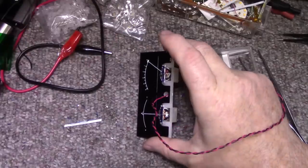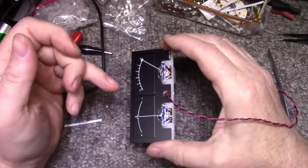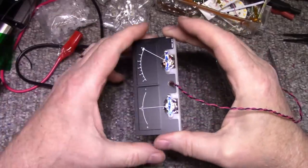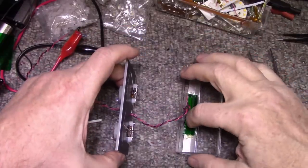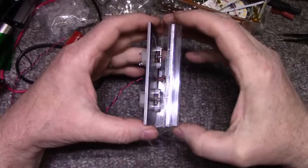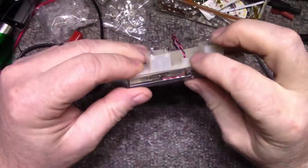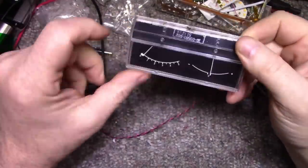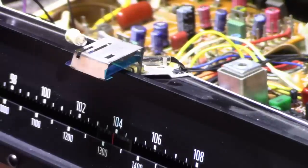It's installed — double-sided tape for the LED strip and two filter layers on top, with hot glue on the edges. The dial pointer is another challenge because it has a black-face dial with white lettering that's illuminated from behind. The light goes through the pointer as a light pipe. There's one wimpy little incandescent here that shines into the pointer from behind the scale, and another that illuminates the dial scale through a blue filter — and that filter is falling apart and very dim.